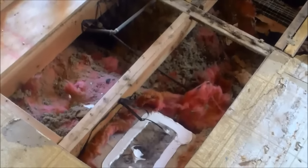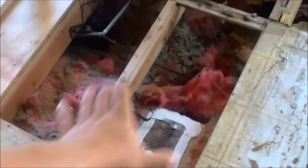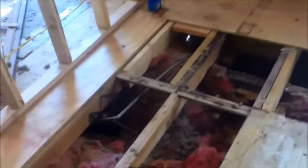I've been wet-vacuuming and I patched the hole in the ductwork — that duct was for the bathroom I removed to make this bedroom bigger. I took a piece of stainless steel scrap, cut it about two inches larger all around than the hole, put down white silicone — the kind meant for bathtubs that resists mold, which also works great for ductwork — pressed it on, then screwed it with metal tapping screws. I went ahead and spread caulk all the way around it so I wouldn't waste half a bottle. Now I'm ready to cut my plywood.